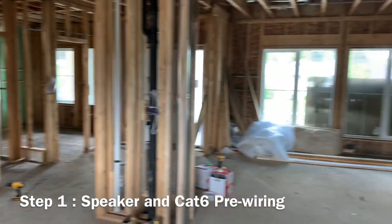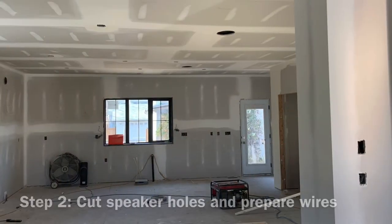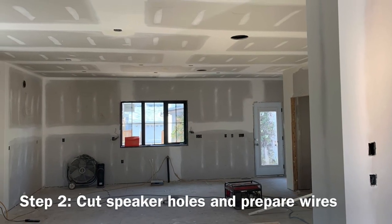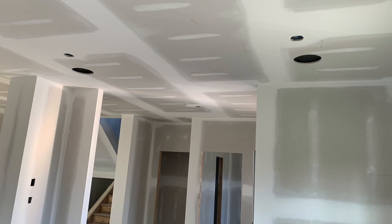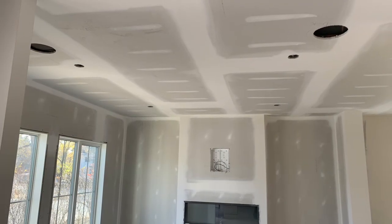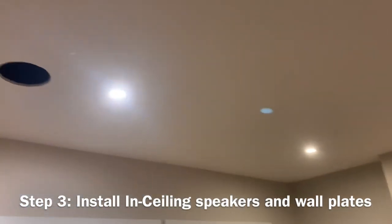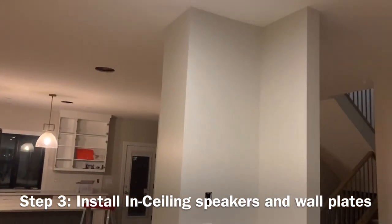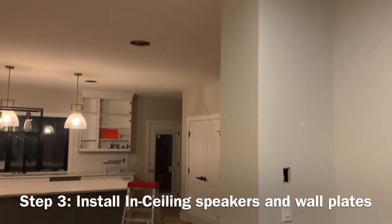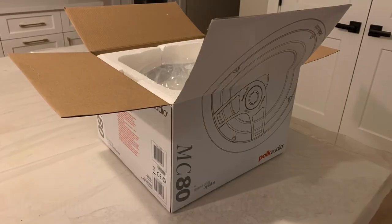We were able to run all our speaker wire and CAT6 cable for internet. Once the drywall was complete, I cross-referenced my drawings to identify exactly where I had speaker wire, and using speaker templates I cut my holes — carefully measuring to ensure symmetry and the right distance for good surround sound. Doing this at that stage is beneficial; if a mistake is made and you need to patch drywall, it's much better to do it then. As you can see, once everything is painted and finished you can install the speakers confidently without any mess.